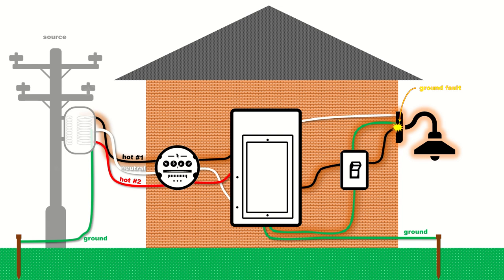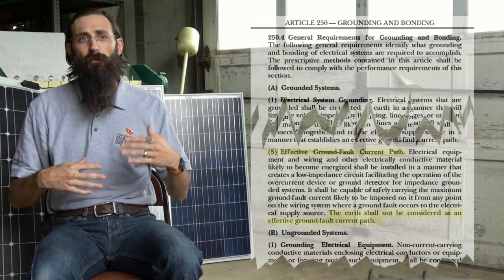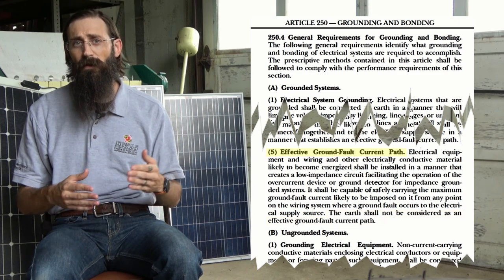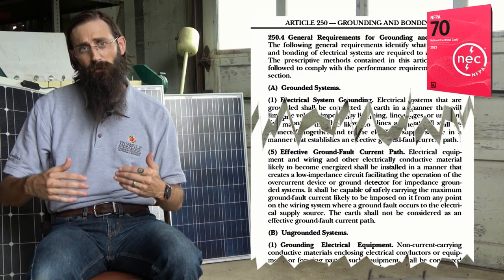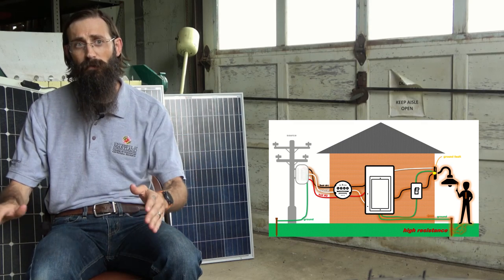If you were to come into contact with a hot wire or other energized component, your body could complete the circuit — the current could pass through your body, through the ground, and into the service panel before returning to the power supply. But the resistance or impedance would be very high, while the corresponding electrical current would likely not be high enough to flip the breaker and cut the power, resulting in a potentially fatal situation. The earth is not considered to be an effective fault current path, as indicated in Article 250.4(a)(5) of the National Electrical Code, with the fault current returning to its power source even passing through your body in the soil, creating a voltage gradient within the soil itself.